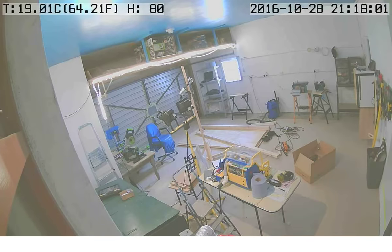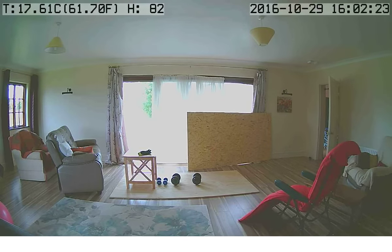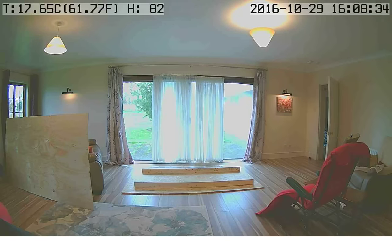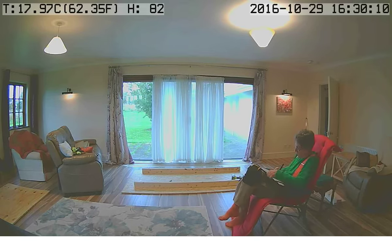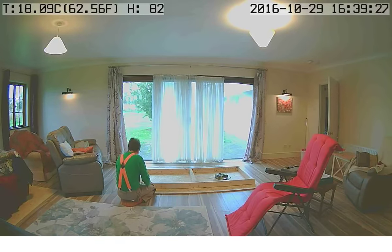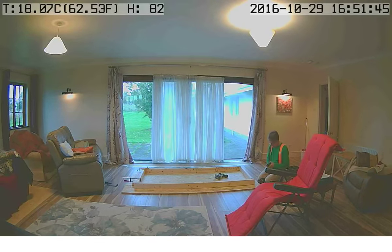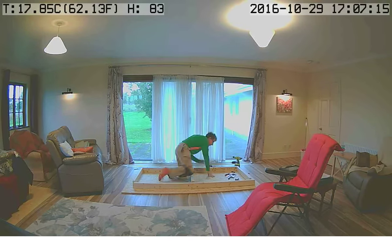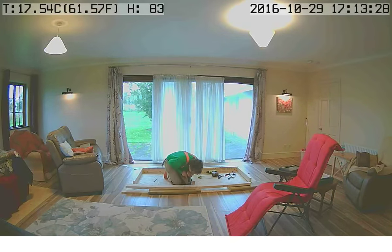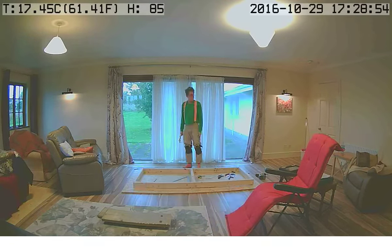Now we've moved into the living room. Put some of the wood in the living room. The plywood sheet there got a bit warped — there's barrel distortion on the lens but it wasn't quite as bad as it looks. So I mopped it with water on the concave side to expand that side, then I put the couch on it to weigh it down. Now I'm building the frame that goes under the table out of those 4x2s, using a right angle clamp to hold two corners together while I drilled them with big long wood screws. I also drilled pilot holes through the first piece of wood so that the second piece would be pulled towards it when tightened.